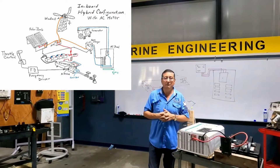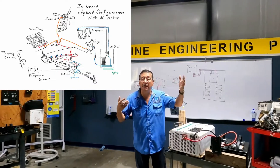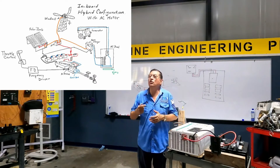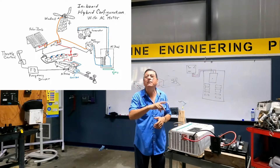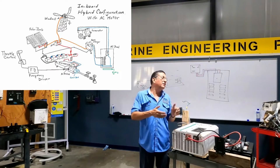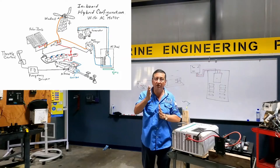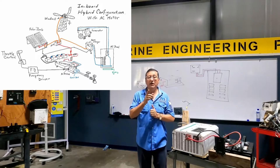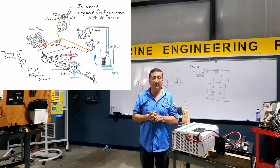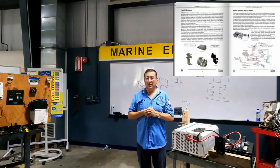In your boat it will be nice because you are in the middle of the ocean — you don't have sun, you don't have wind — and you start the generator only to recharge the battery bank, not to use that power directly in the boat, because the rest of the boat is configured DC and the inverter supplies power for the rest of the boat. This is a hybrid boat. I recommend thinking about the hybrid boat in the future. I am writing another specific book specifically for hybrid vehicles.